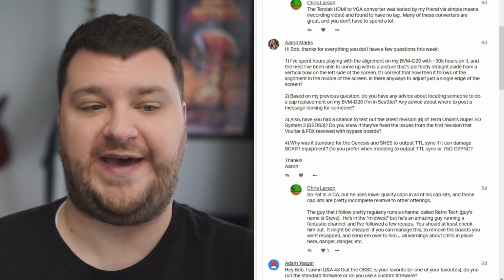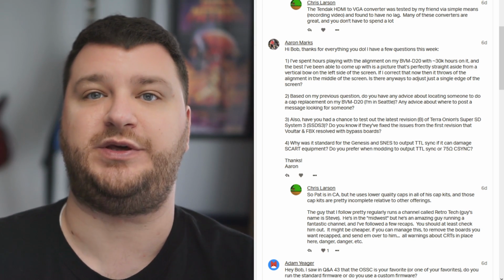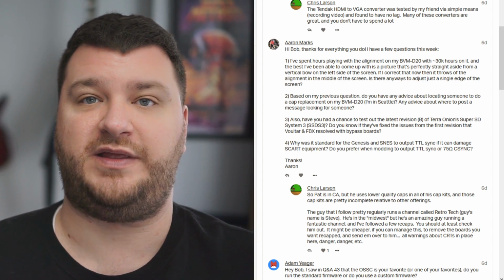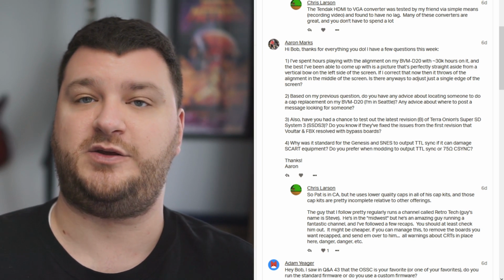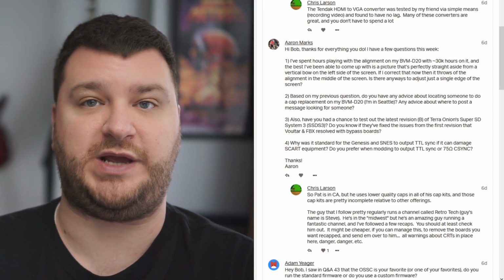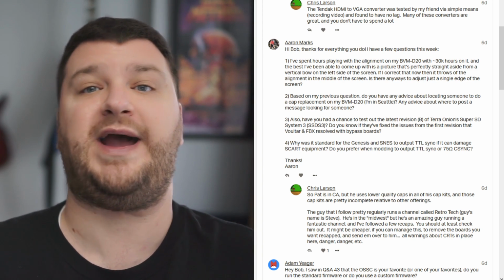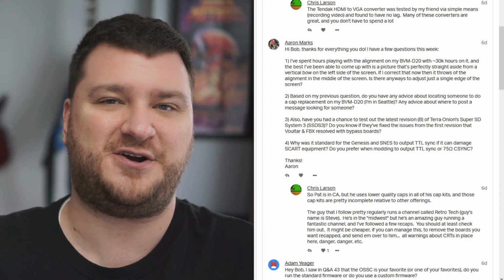Because the fact is, somebody else at some point will probably use that console. Or you might even forget. So if you've modded one that outputs direct 75 ohm C-Sync on the sync pin, and then you make yourself a custom pass-through cable with no components in it, electrically speaking, that's better. It's better practice. You could technically get a 0.01 better video signal out of the RGB lines.